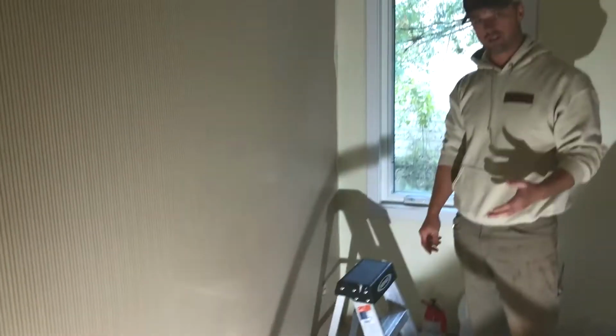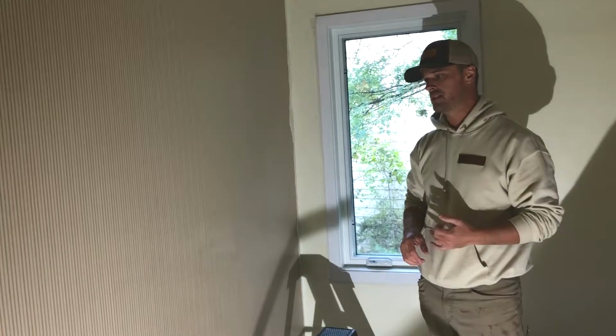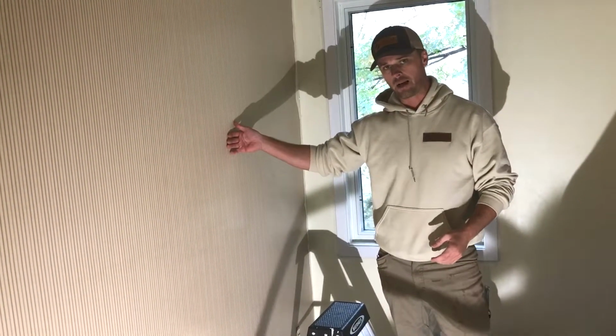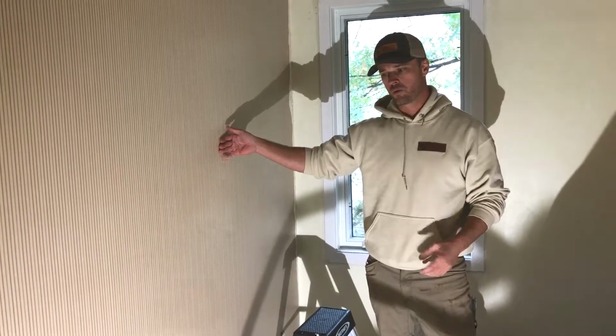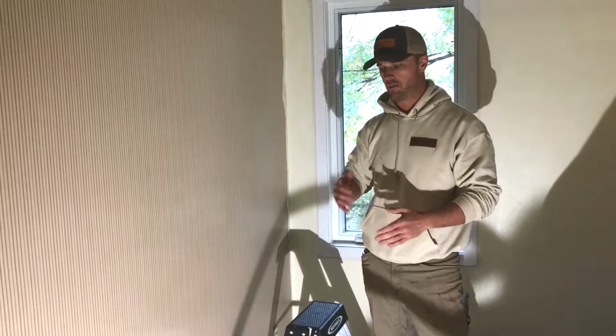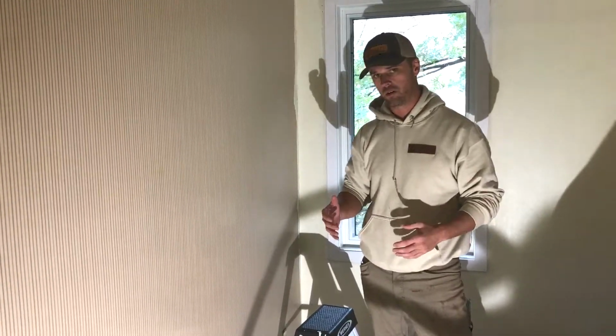So we have those set up already. That's what we've already removed these walls with, the steamers, and it just took a few hours. So the one drawback to using a steamer is that it's slower, but the positive is that as you're steaming it, it's going to remove the top and the glue backing all in one stretch. We're still going to spray it with diff and wipe it down with a sponge afterwards, but you kind of are able to knock 2 steps out at once.